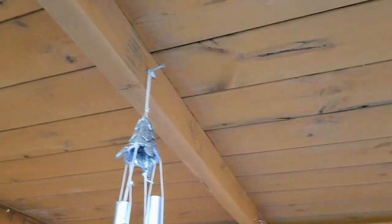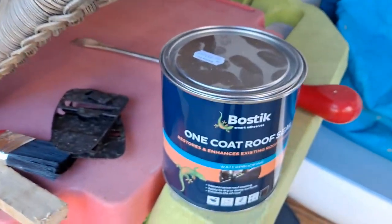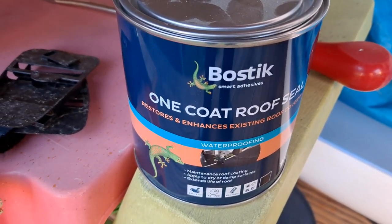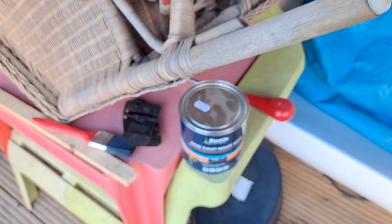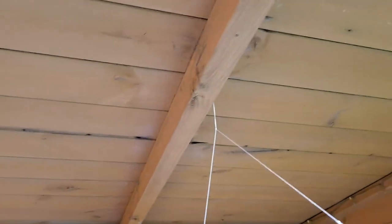So although I think we've improved the situation, I've been out to B&Q and bought myself the proper thing — that was about £15. I shall get up there and brush this over the top of the stuff that I've already done, and that should do the trick. There's just the tiniest bit of damp down there where there was still some damp coming through. It's just possible it may have been water already underneath the felt that I've sealed, but I don't think so — I think we actually had some fresh water come through.